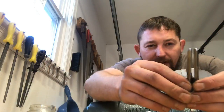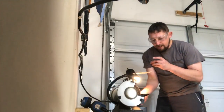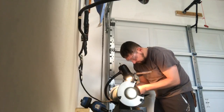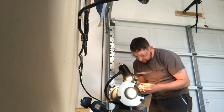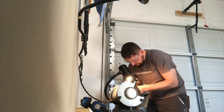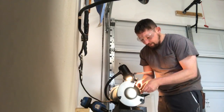Now, through all that adjustment, the ends of my frames are just a little bit off. I'm gonna take and buzz it. Let's go over to the grinder, and just buzz it off and then re-grind it to match. I'm gonna stop it and look in to make sure things look okay. Now that's about how I want it to look. We'll get that burr back off there.